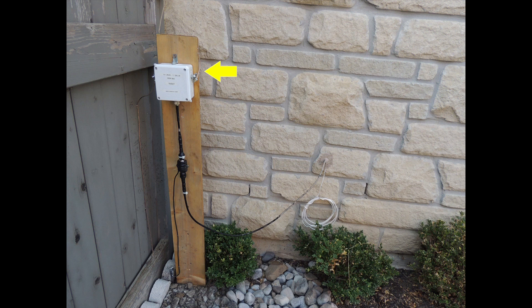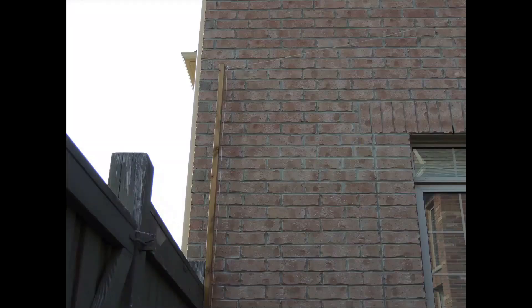Let's follow the radiating element. I stapled the wire to the fence board to relieve pressure between the connector and the antenna wire itself. Now let's follow this wire as it rises up to the top of this pole. This wood pole is a 2x2x8-foot pressure treated lumber — I will call this pole number 1. On the top of pole number 1, I installed a carabiner to support and guide the wire to the next post by the gazebo located at the middle of the garden.